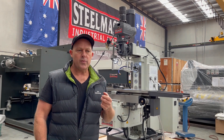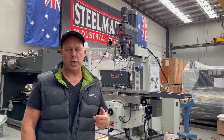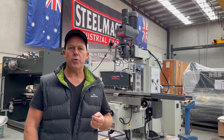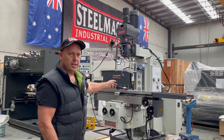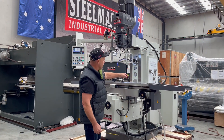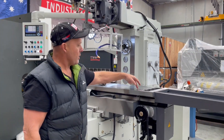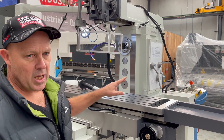The table feeding length on the KD7, which is a very important key feature of this machine, is 1100mm long. So it's a ball-screw drive 1100mm table feeding capacity. As you can see, it's got a large heavy duty set of table, so we've got plenty of T-slots there to suit your heavy duty machining.